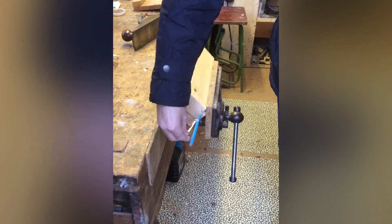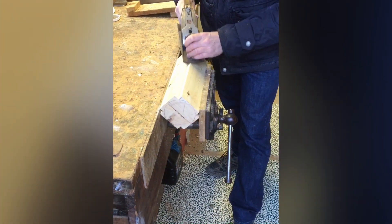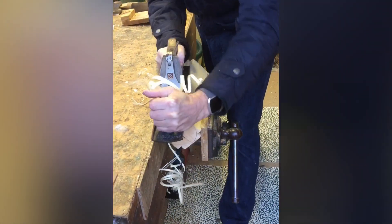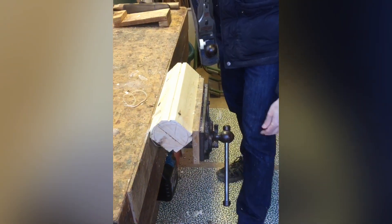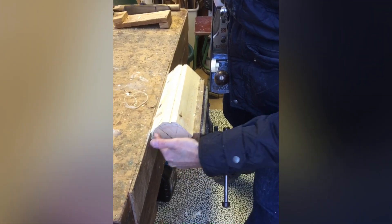Going back to the turning, you can achieve that diameter, mark it with a compass and we're going to now use a jack plane to take off that edge there. I'll start by taking off this — you might just want to start fresh and take off fairly large pieces in one go, and just keep going. You might need a little bit of strength on this one. We're going to do that all the way around and achieve the overall rough circumference that we need.